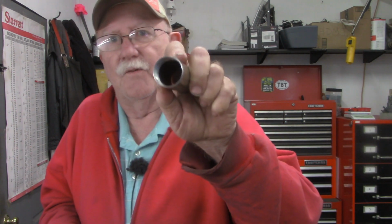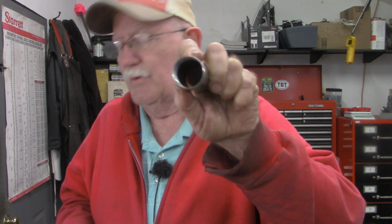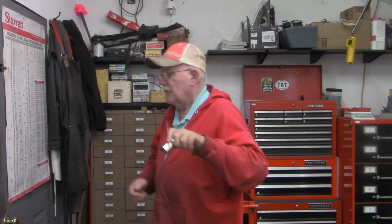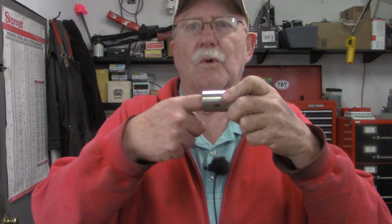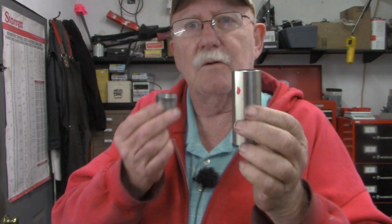Such as if you've got an internal 5/8-11 thread, it'll tell you that you need a 5/8-11 male, and you need a 17/32 hole to start with to do your internal threading. But what if one of these, the chicken or the egg, whichever came first, is a non-nominal value?